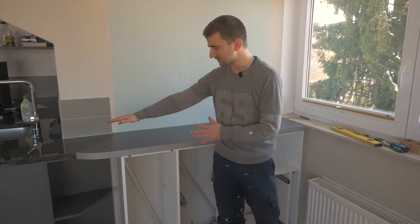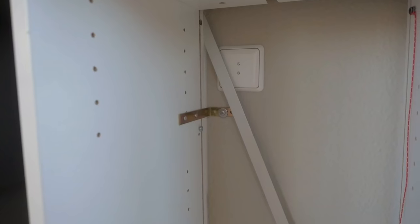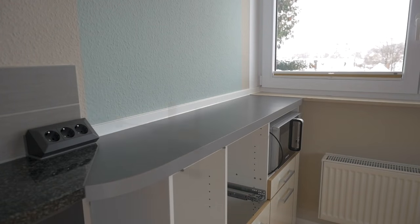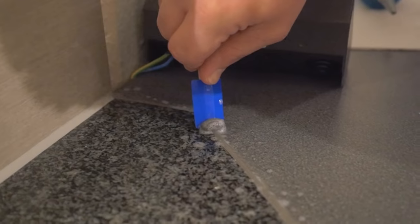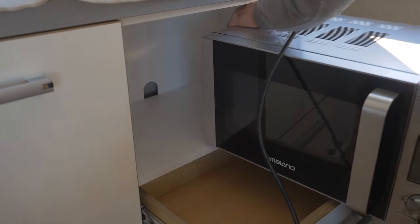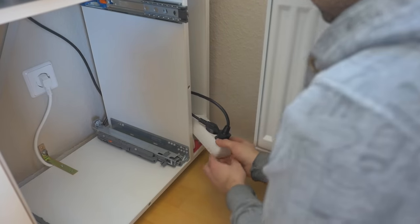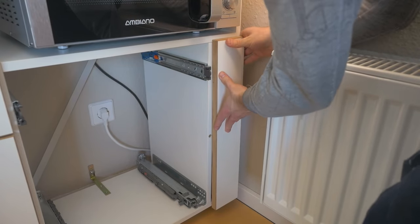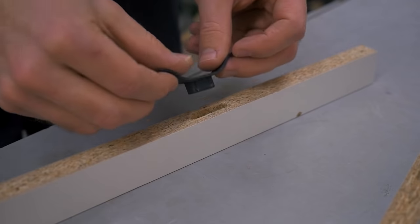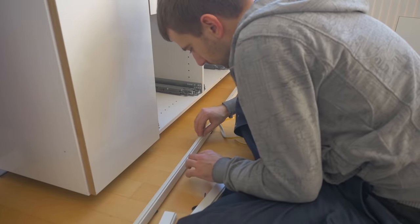I'm happy with how that turned out — this turned out great. Adjusting the whole cabinet so everything is nice and level, aligned, and square took a really long time. But it's done now, and of course the whole cabinet is also screwed to the walls so it won't move or tip over. Then a few finishing details like trim and some more outlets. My brother-in-law did all the silicone work and that turned out beautiful. The microwave oven is added — I can hide the cord neatly behind everything and plug it into an extension cord behind a cover that I changed to a snap-on system. The last part was making trim to close up the gap on the bottom, held in place by a 3D-printed spring bracket that fits into a slot and presses the trim onto the floor with weather stripping as a seal.